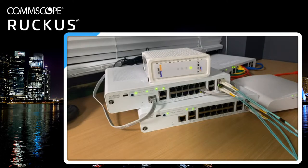Oh, yep. So it's not just a straight raw cable that goes from the doorbell down to the comm box where the ICX is. There's an actual patch panel in there. Because if that's the case, if they went A on one side and B on the other, that's a problem. You want to be on B on both sides. Yep. Okay. If that's the case, Andrew, you might have a patch that's done incorrectly.